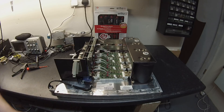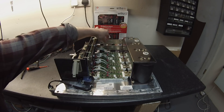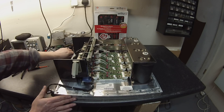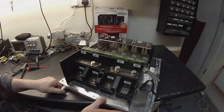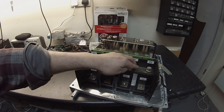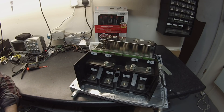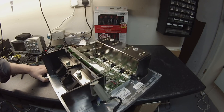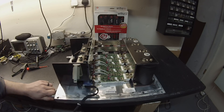There are absolutely shiny laminated copper bus bars, and the size of the bus bars feeding the DC in on the DC link is insane. Rotating around to the front, this is where the DC connects. We've not three but four phases output, and indeed there are four half-bridge modules in there — normally to drive a motor we'd have three, but we have four. It's got a big aluminium liquid-cooled heatsink.